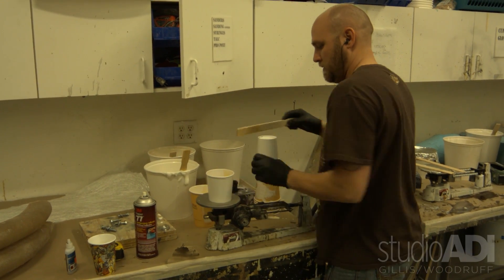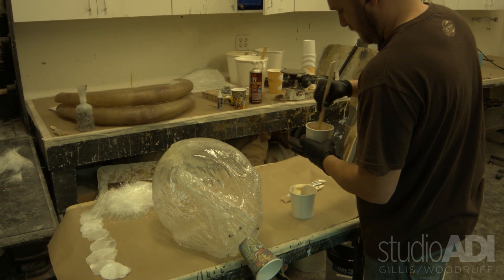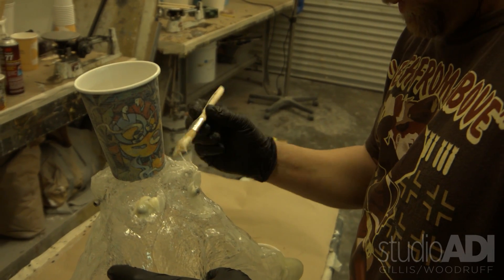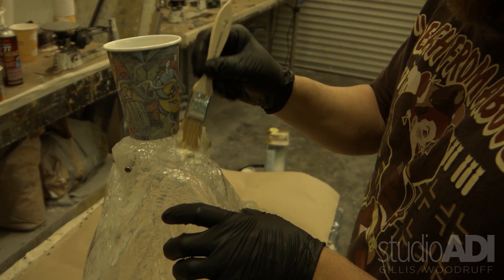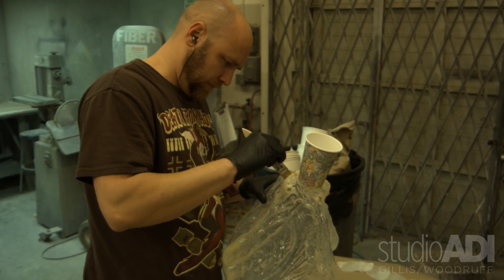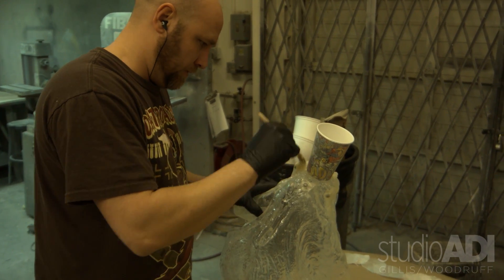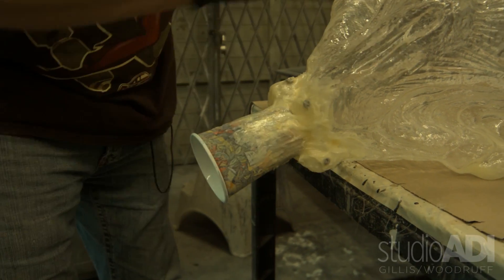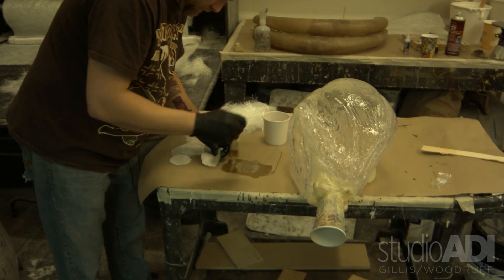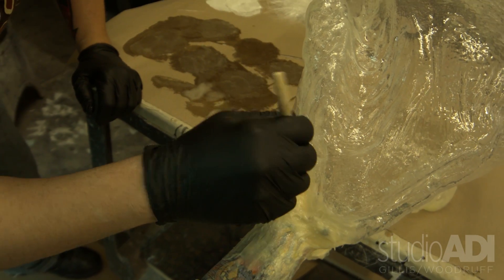Right now I'm fiberglassing on top of this very high-tech instrument called a paper cup. The fiberglass I'm putting on this thing is going to support all the weight of this dome with the water inside of it. So I had to put screws in it to hold this what's called a mud coat — butter batch, whatever you want to technically call it. And then on top of this I will fiberglass, and that'll be suspended with wires through holes. That butter batch is cabosil and polyester resin mixed together — basically just fiberglass resin that's been thickened up. Right now I'm taking fiberglass cloth — not fiberglass mat — and doing several layers over the edge and eventually over this cup.